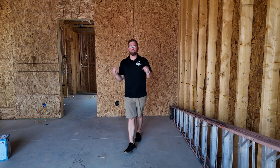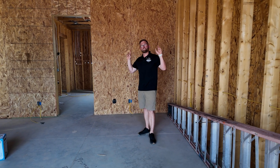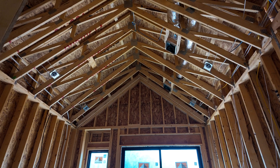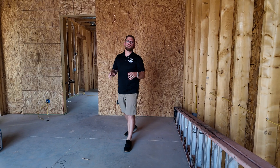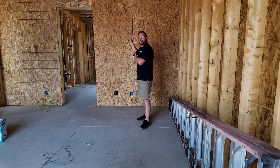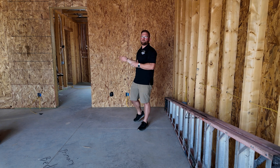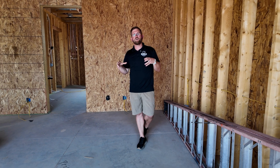The primary bedroom is by far the most important in any residence, and it's no different here at Modern Row Home. We're able to get a 10-foot top plate with a steep vault — in this case we went with parallel cord trusses to match the exterior pitch of the roof deck and create the most volume within this space. The way we designed this house allows people to truly live their best life, as the primary suite does not reside underneath the rest of the upstairs living, giving the homeowner a space separated from the entertaining areas to come back to at the end of the day.